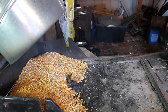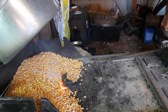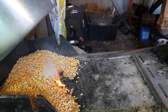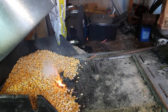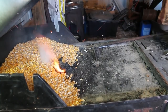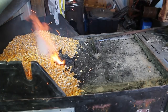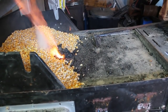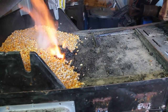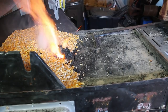So we're running this in real time so you can get an idea how long it takes to get a decent fire going. When corn cokes up, it's very stable. It will form a lid to the firebox. And whatever coke is in the burn nest will burn out before the rest of it falls into the nest. So it's a fiddly kind of fire. You have to constantly be poking new coke down into it.